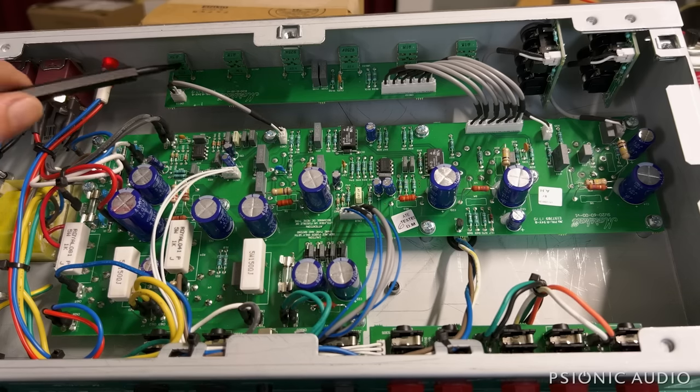There are some characteristics about it that I don't care for that I would certainly say, aside from the iffy quality of some of the build, keeps it from sounding great. There's a fizziness at times you might have heard. Hopefully I'll have pointed some of those things out with some graphics. And I don't know how much of that is the very cold cathode bias, where this is going to be guaranteed to be going into crossover distortion. I'm sure I heard a good bit of that.